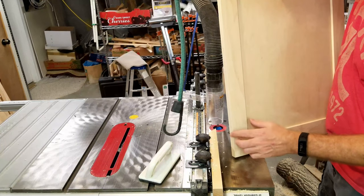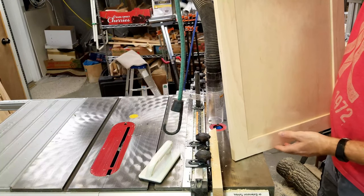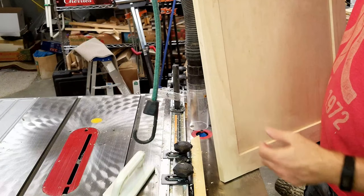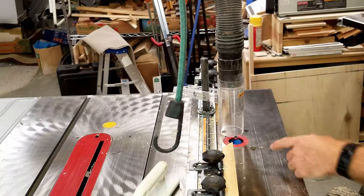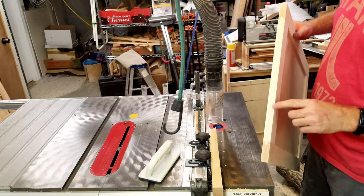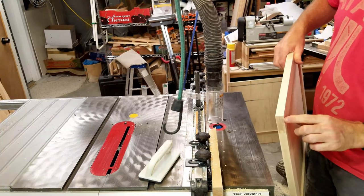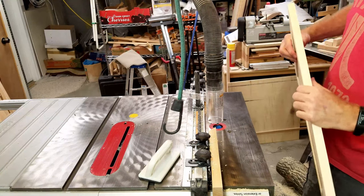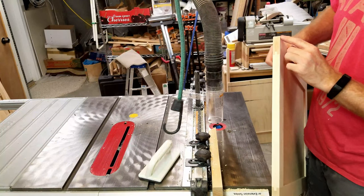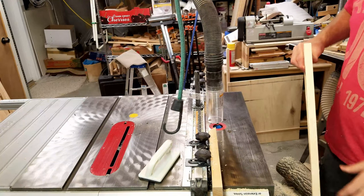What I'm going to do is put a chamfer edge about a quarter of an inch all the way around the outside of the front of my door panel. It'll really break the edge and make it much nicer — adds a little variety too. I've got my chamfering bit on. You want to start on your stiles that have end grain first, because if it splinters out, your next pass down the stile will chase the chip out. That way you end up with no chip-out.